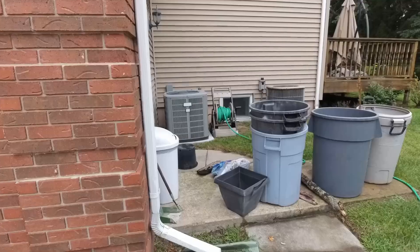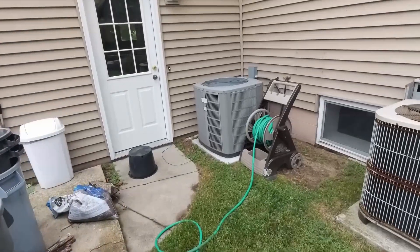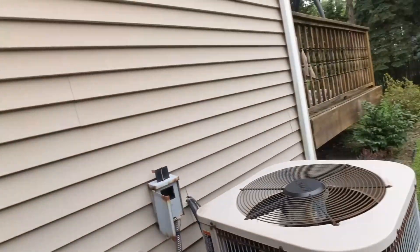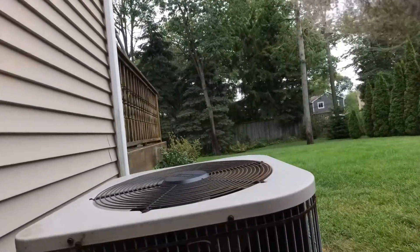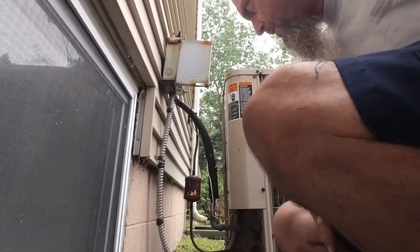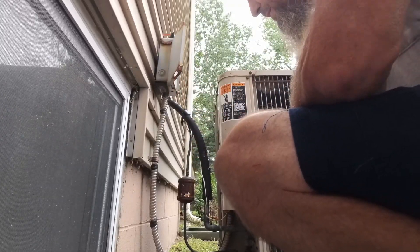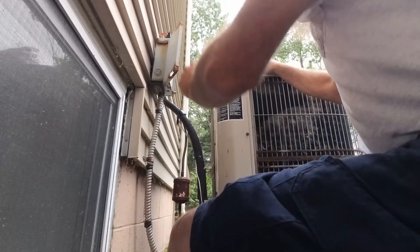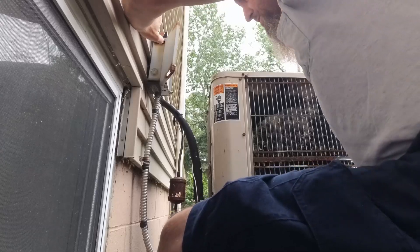We got a larger house with two ACs here. Worked on that one two years back, put a capacitor in it. This one's an older Lennox - never worked on this one before. When I started it up, downstairs felt like it came on, but when I got out here it was blowing cold air but the compressor wasn't running. Then it started up, so let's see what we got.